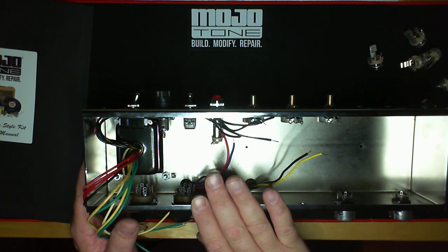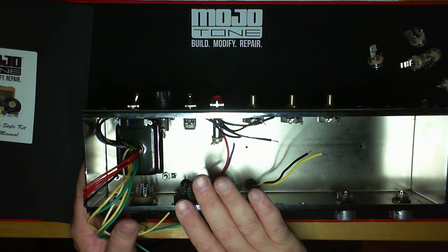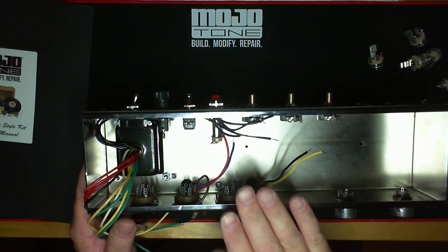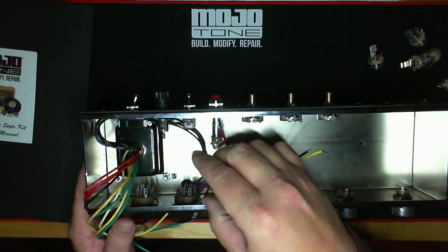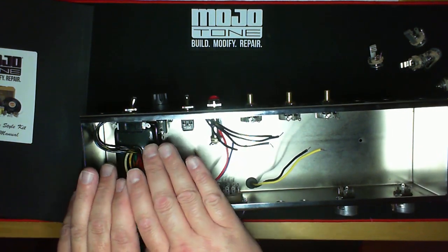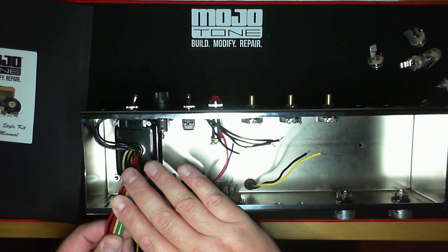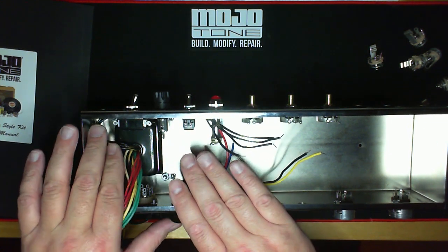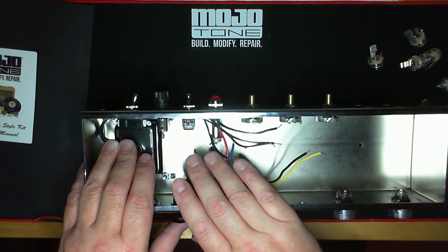Keep in mind, we're talking about an amp that came out — the 5C3s were '55, '56, I believe. They're 60-something years old. It's crazy how old these things are, and they're still gaining momentum. That's why we started including the export transformer on basically all of our kits now, because the domestic transformers were not that much cheaper than the export transformers. So it's an advantage to have these — honestly, it's kind of a no-brainer.